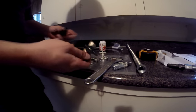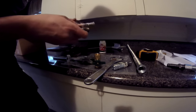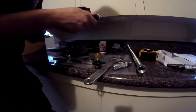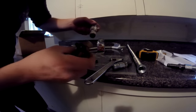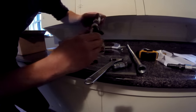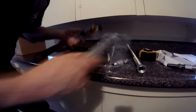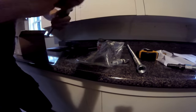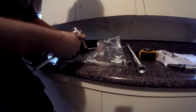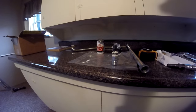That's ready to go into our furnace. As I said, we've got to replace that shutoff valve, so we're going to get this prepped as well. Dope up our half-inch two-inch nipple so it can go into our flared fitting for the appliance connector. Soap that up really well, and then we're going to thread on our new shutoff valve. I always like to exercise my valves before they get installed. Take our crescent wrenches and tighten these down together — righty tighty, lefty loosey — as tight as we can get them. Take a minute and clean your fittings off.